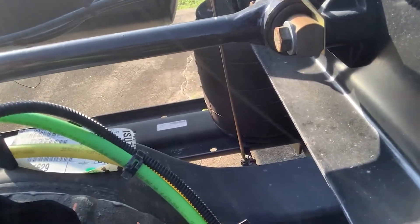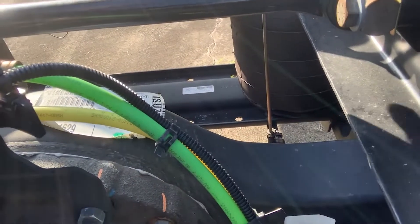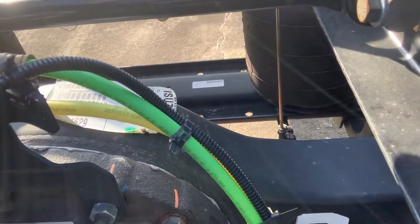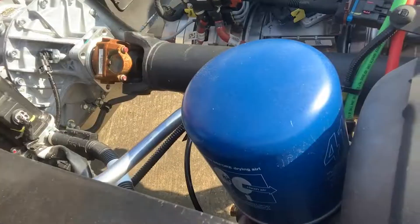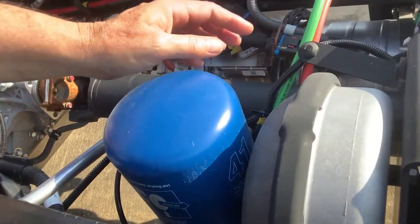The level ride of the truck is managed through this rod here to keep a constant height. When we do a dump on the interior, that releases the pressure to let it down. When we charge the system, this self-leveling valve has a kind of shutoff — it's akin to a toilet bowl: when that water gets up to the right level, it cuts off the air supply for your suspension. The black line that feeds out of this is the line for our air ride seat.